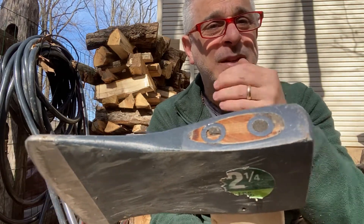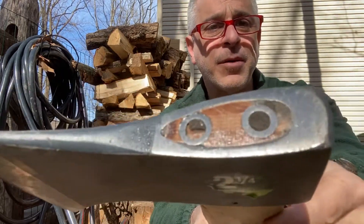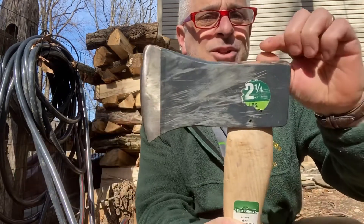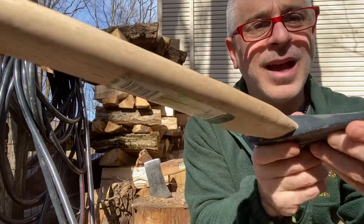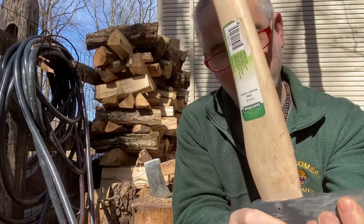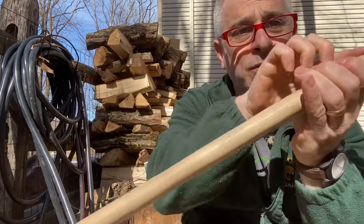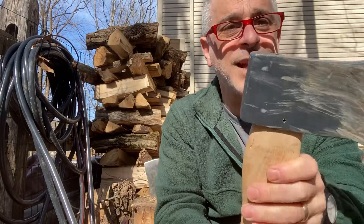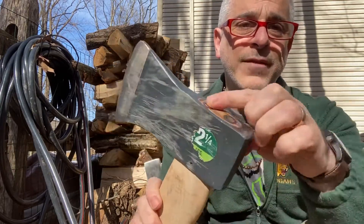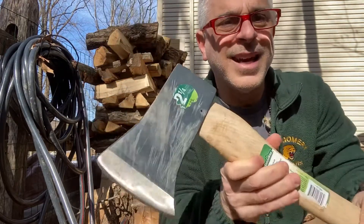You can see how it's hung with these round wedges — it's a pretty good fit. It should be proud, sticking up a quarter inch, and it's not, and that's a bit of a problem. On the other side there are some gaps, and it's curling. That curl there means the head was placed down firmly on the handle, which curls the wood. When you see those curls, that's good — that's steel on wood, and that's what you want, as much steel on wood as you can have. If it starts to come loose you'd have nothing to play with up there and you'd probably have to replace the whole handle, but for a weekend guy like me, so what? I like it a lot.